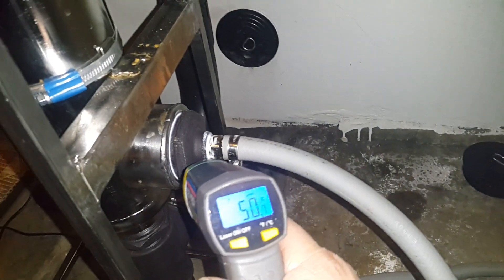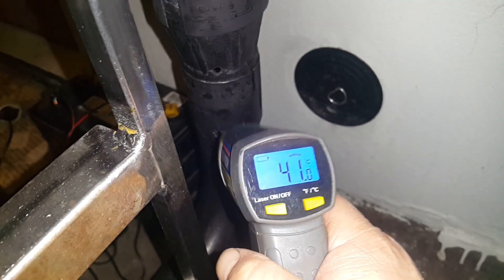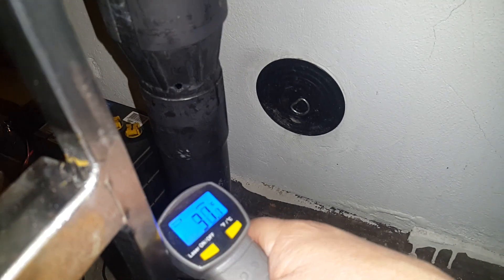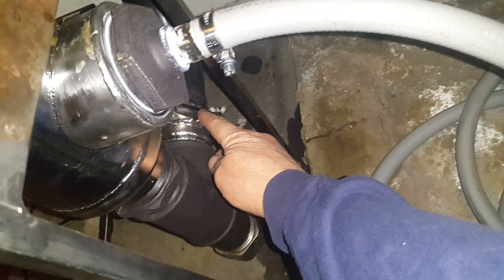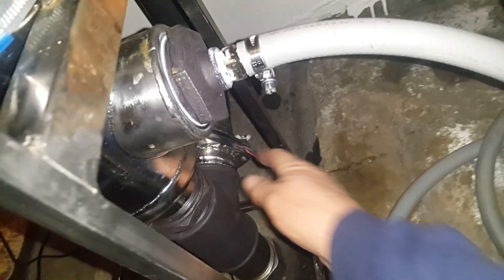We're boiling with that crackling. Water going in at 50°C, and our exhaust is only 40°C. So almost all the heat — other than the temperature of the water itself — is being captured. The exhaust at 100 degrees is well within that little muffin fan's operational parameters.